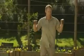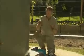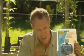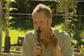The difference in height between the top of the garden beds, which is where the drip lines are, and the outlets on the water tanks isn't big enough to run a gravity-driven watering system. So what we're going to do is install a pump just to build up the pressure. And at the same time, we're installing a pressure-reducing valve which will get the water flow just right to suit the drip emitters. Also, we've got a programmable water controller, battery-operated, nice and simple. And, very importantly, an inline filter. That'll stop any dirt or grime getting into the lines and clogging the drip emitters.